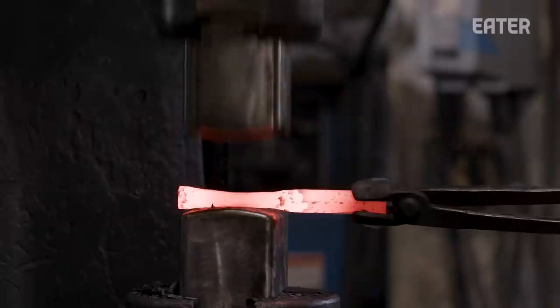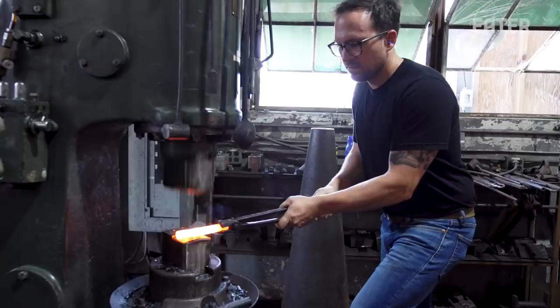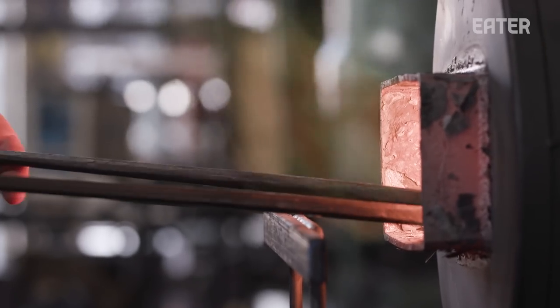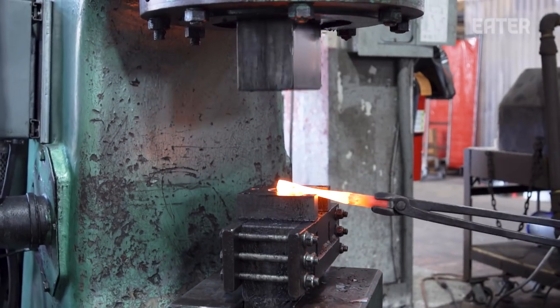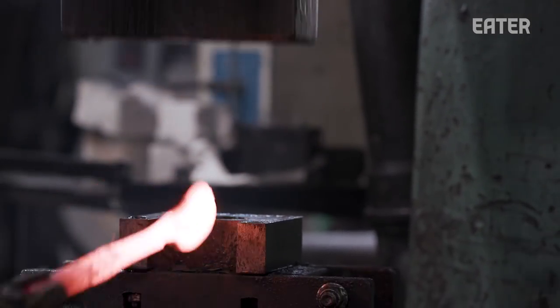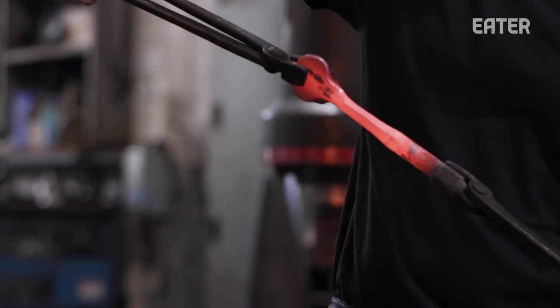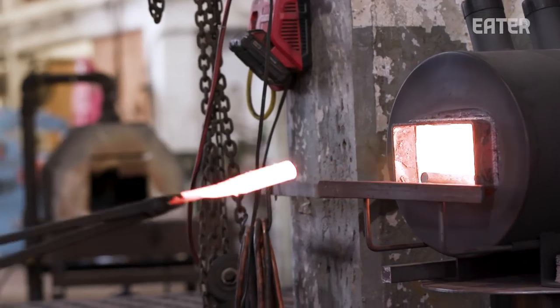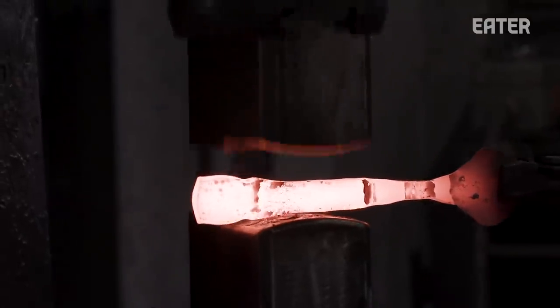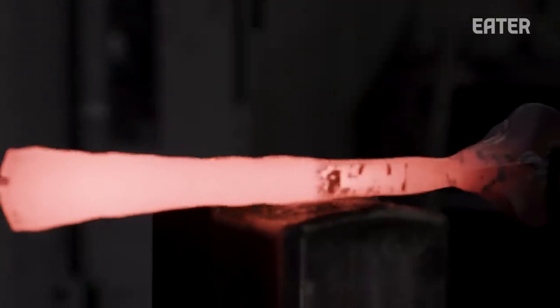To form a handle, we heat it up in the forge and start to draw out the neck of the handle using one of our forging hammers, creating an hourglass sort of shape. We take that little nub and put it in our bottom die under a larger forging hammer, splatting out the cusp for the handle — the portion that gets holes in it and gets riveted to the side of the pan. Then we stretch out and shape the part your hand holds using open die forging, which is all about how you hold the material between the dies.